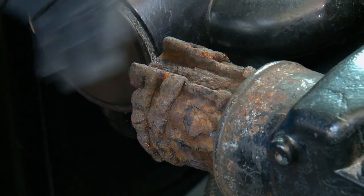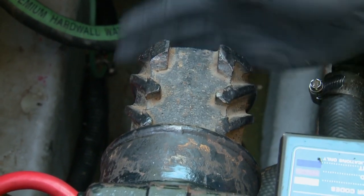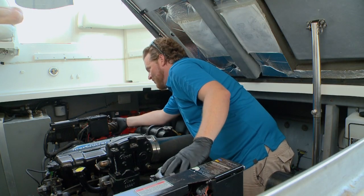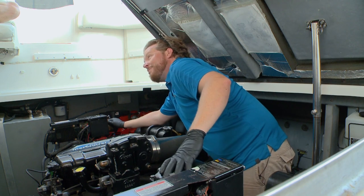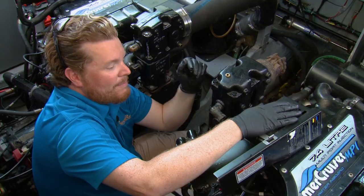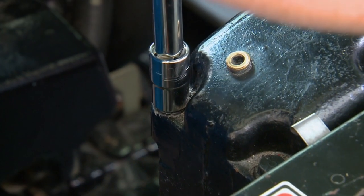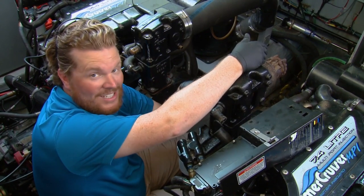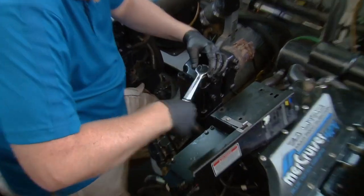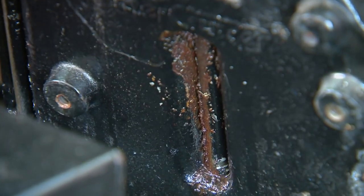No big deal though, we can change it. To give you an example of how bad this is, we took the hose off the same exhaust elbow on the other engine and it is in very good shape, which leads me to believe this one was actually changed right before we bought it. We got the raw water hose off, the exhaust hose off, and the electronic module box off, and we sprayed all four bolts with WD-40 because given how much corrosion is here, this has probably been in place for quite a while — we do not want to break these bolts off.